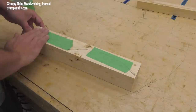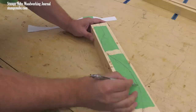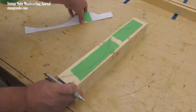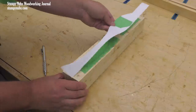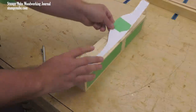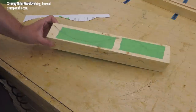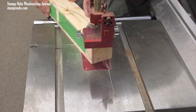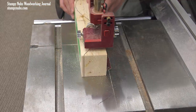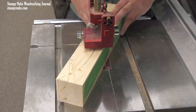Reassemble the two halves of the blank and use some tape to hold them together. Note how the template lines up with the original cut that you just made. Keep that orientation of the template, but roll the blank 90 degrees to the right and trace the template again on that face. Again, try to cut smooth curves — drifting away a little bit is better than making sharp corrections, because we're going to essentially turn the blank inside out.